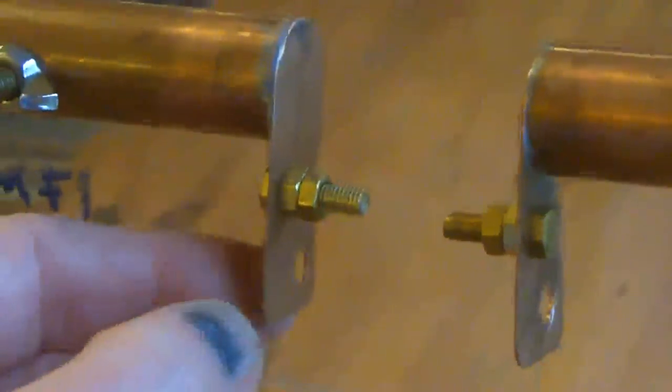This is again just a strip of copper made from the tube that I've put onto there. And I've put them this way particularly because the current will flow that way. If you put them that way on, then you'll be expecting all of the current to flow in the very edge. So it makes practical sense to put it like that. And then the current flow in the capacitors again is in the same direction. It's flowing across the capacitor.